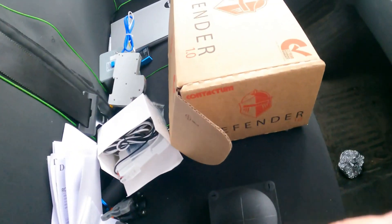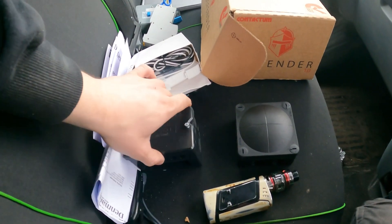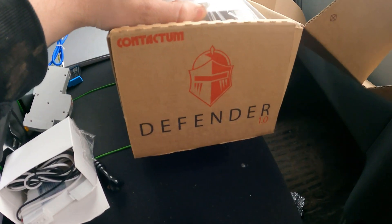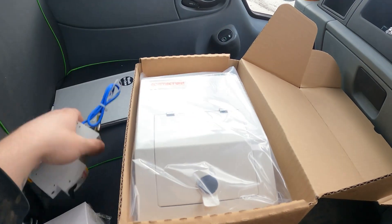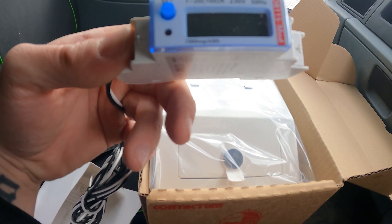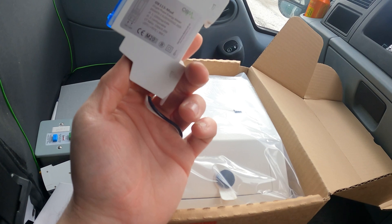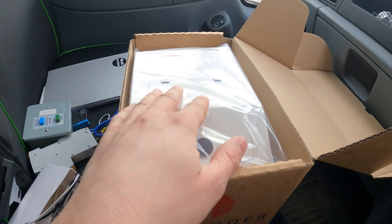I'll show it you anyway. What we're going to be doing is installing a little two-way consumer unit. We've got the Henley blocks, whisker boxes for the outside. This is a Contactum two-way with the main switch. One RCBO to go in one of the ways. And then we've got this little single DIN-mounted kilowatt hour meter — a single phase energy meter with a little CT clamp. So that'll take up the two ways in this little board.